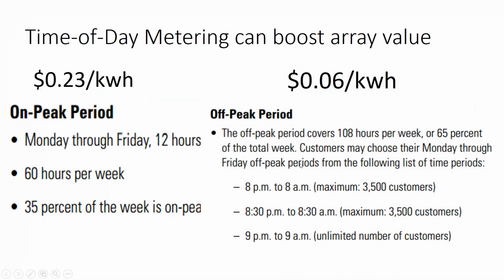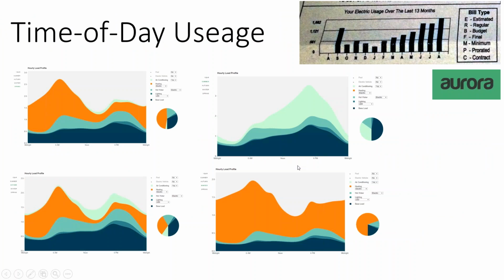There's also demand rate structures, which in our battery class, we talk about how in the past, demand rate structures have been terrible for solar, but now when you add a battery, they can often result in paybacks that are faster than solar, particularly at the commercial level where it's not the volume under the curve that's being billed, but instead maybe 2/3 of the bill is the maximum peak.